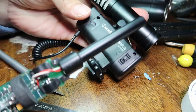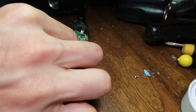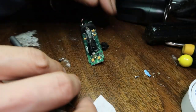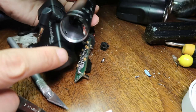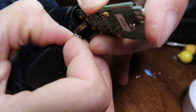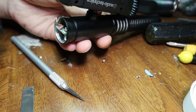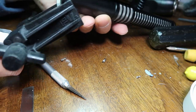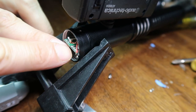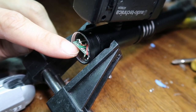Okay, let me put this back together. Here was the microphone over here. This shoves inside. There's these little pins; this thing goes back on here. These little pins go on here for the little switches. Once I push this back in, I have to connect these cables — solder these cables back on. So these little wires, I always forget where they connect to, which color is which. So I always take a picture before I unsolder things. Now I'm going to look at the picture so I'll know for sure.